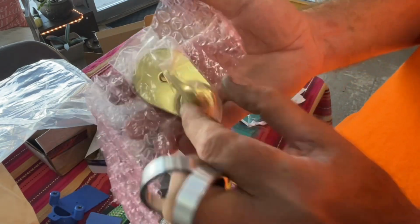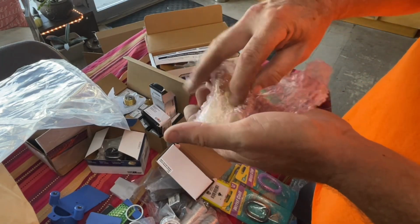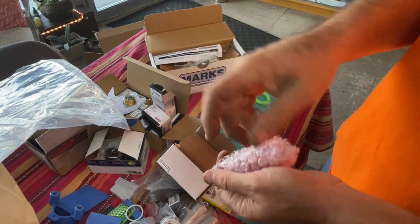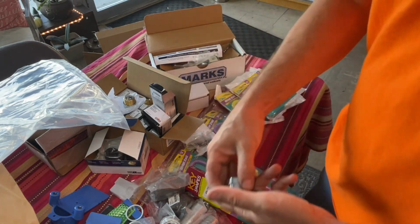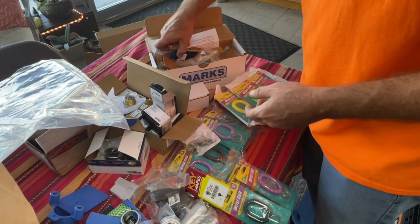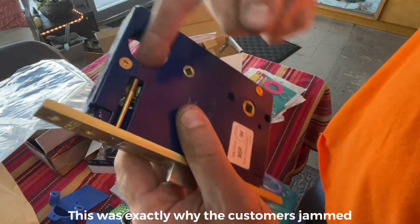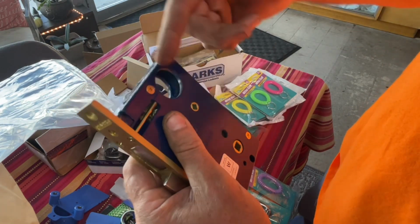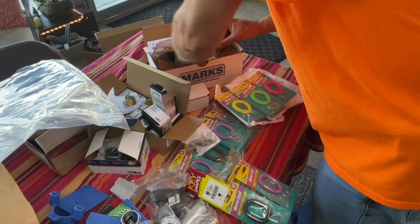But that covers up where the cylinder is, activates that. Because if you try to use a thumb turn cylinder, the thumb turn cylinder is allowed to rest in any position, and it jams up when you try to use the key from outside, and the thumb turn is turned on the mortise lock on the inside. What happens is that cam will be sticking down, and then on the other side, when you try to throw it, it'll jam it up. In fact, the directions specifically say that will happen, and it does happen.